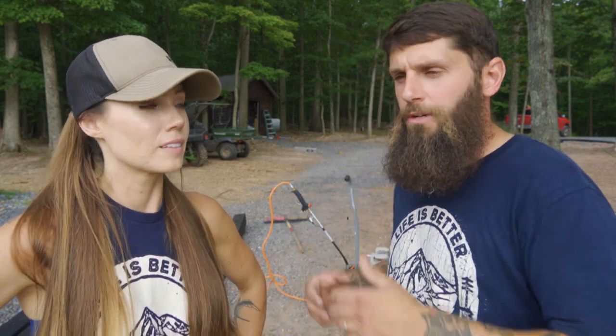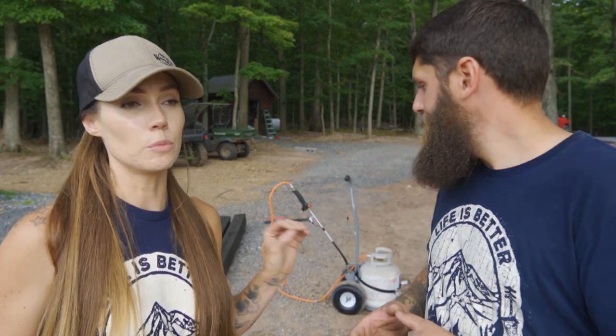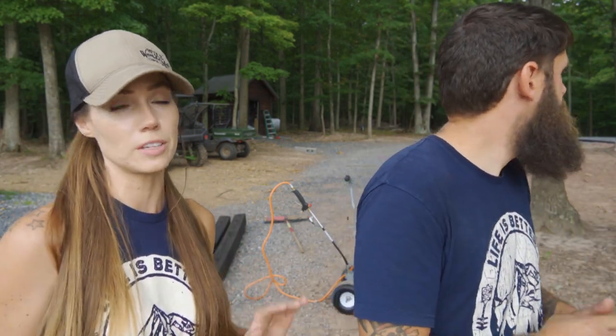So it's gonna go up, it's gonna stick out like a sore thumb, so it's gonna be very dark compared to the rest of the house. But as we went along doing it step by step, it's always dark when it goes up first and then it lightens up and it all evens out and matches. So give it a few months, it's gonna get to the same color as the house and it's gonna look great. If you guys remember, the last dormer that we put in was actually this front door dormer that we're working on today. Yep. And when it went up, it was very dark and it didn't match. Black. Yeah. It was exactly like these are. But now, after having been out in the sun and exposed to the weather, it matches the other dormers and the powerhouse. So this will match the same. Just heads up, it's gonna go up. Yes, we realize it's very dark. It'll all work out.